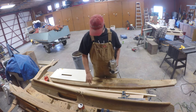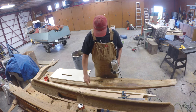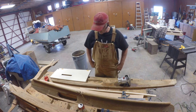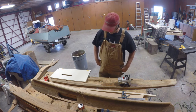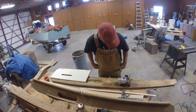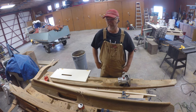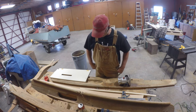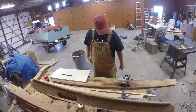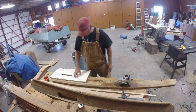So I could take the toe rail off, but it is screwed on with standard screws that are behind bungs. I tried to take one off the other day, and it was a complete disaster. The bung didn't come out completely properly. It must be glued in or something. And the standard screw stripped, and I never did get it out. So I glued the front end without actually taking the toe rail off. So I think taking the toe rail off is not an option.